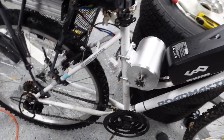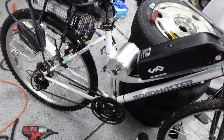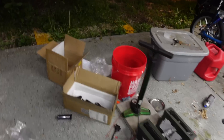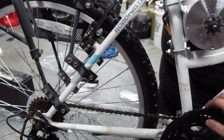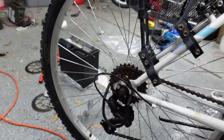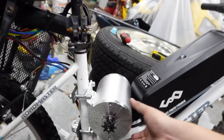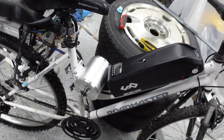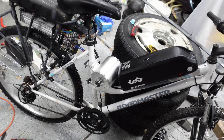Apparently the primary gear reduction was not enough and it just instantly threw the chain. Where did the chain end up? Looking for something shiny — hey, that looks intact. I don't think I can get a smaller sprocket. I might be able to get a cassette with a larger rear chain ring, or maybe welding a bracket and using a tensioner is the actual move. I'd really hoped that would be enough gear reduction to not stress the motor — apparently I was wrong.